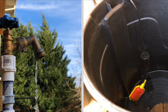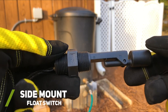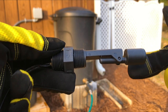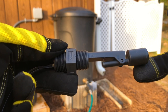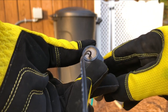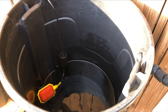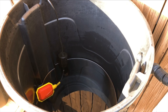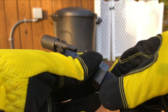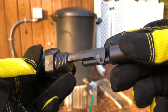It was great to see that both tests passed for my application. Another device I was considering implementing is a side mount liquid level switch, which would allow you to define your low point much easier and allow you to immediately use your pump again after the water level rises above the low point, unlike the float switch where you may have to wait until the rain barrel is refilled at least one half to three fourths of the way before the system thinks there is enough water. For my application these were not a large concern, but I just wanted to throw this option out there in case someone found it useful.